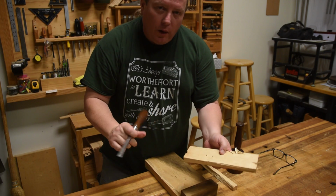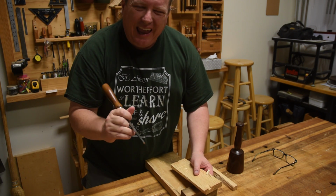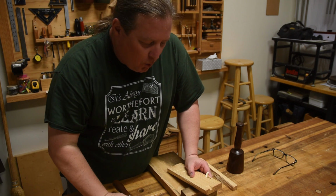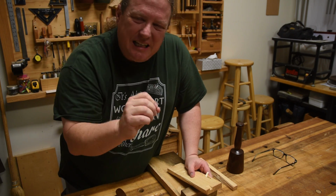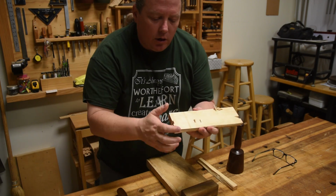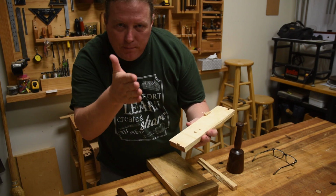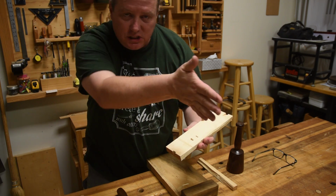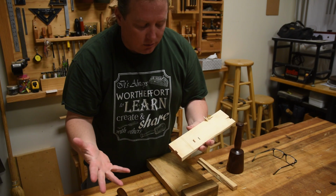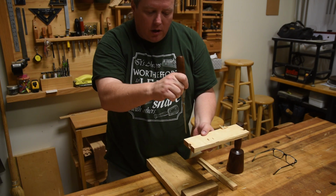We then went with the grain in that same slicing tool. And did you notice that not a lot of wood was coming out? We kind of sliced it and then compressed it. It didn't really move anywhere. Whereas when we were going across the grain, if you slice one side and then move over about a 16th of an inch and slice the other side, the wood in the middle just kind of falls out. Then we went to the edge and we went straight across the grain.